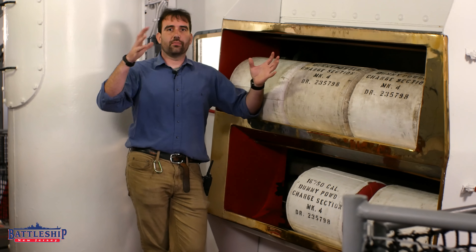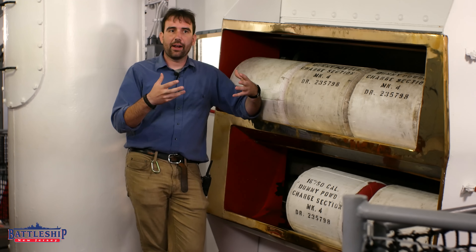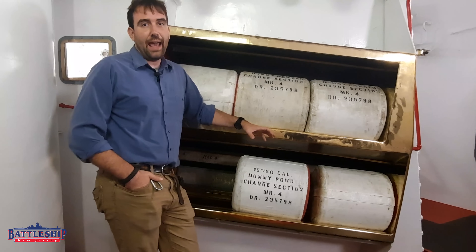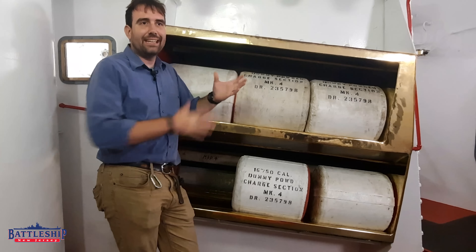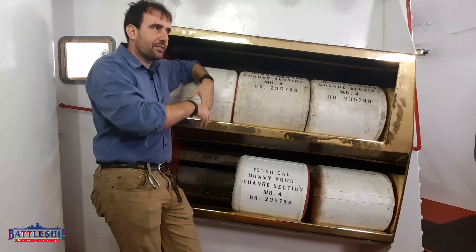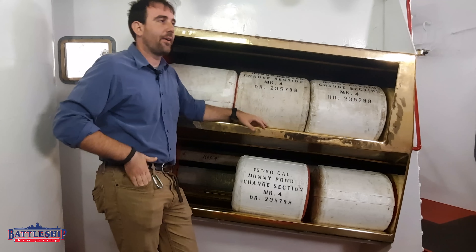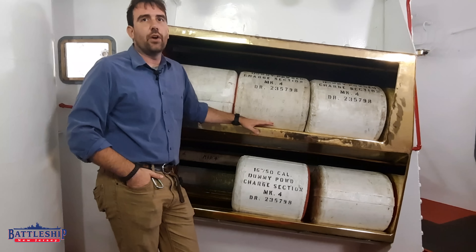This additive atomizes when the powder bags go off, coating the rifling of the barrel and preventing the corrosive gases from wearing it out. In the 1980s, a further additive — basically a polyurethane sleeve — is wrapped around each of these bags, which shows up in pictures as a black sleeve. It is an additive that atomizes during the combustion process, coating the inside of the barrel, and that raises the equivalent service life of the barrel to something like 1,500 rounds.